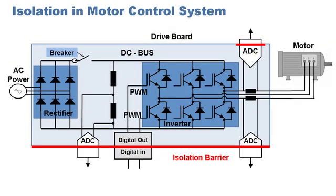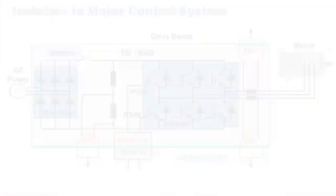Let's focus on one of the two levels of isolation in the motor control system. The isolation barriers show the functional design of the system. Optic couplers are replaced here with gate drivers and CurrentSense devices. The integration and performance of their digital isolation technology in the gate drivers and CurrentSense isolated converters allows designers to optimize switching capability and sensing accuracy of the measured currents. Incorporating iCoupler digital isolation into motor control systems not only ensures that proper isolation will be implemented into the system, it also provides performance, integration and reliability advantages over solutions that use opticouplers.